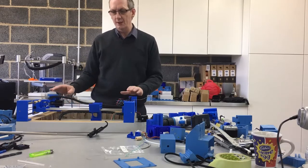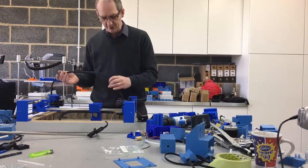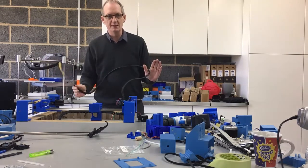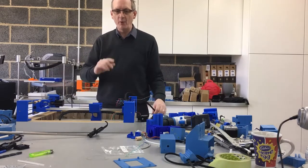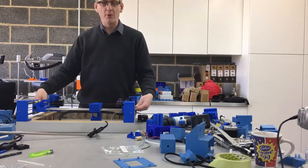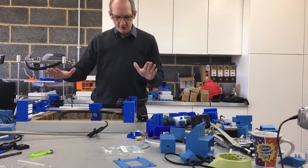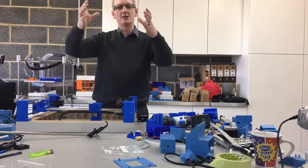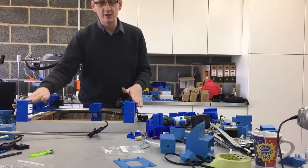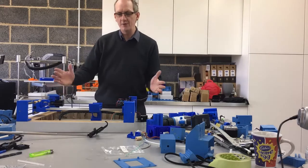That's a quick video showing how the GT2 belt goes in. Both motors are now mounted. We're going to move on to a bit more of the wiring for the printhead before we maneuver to building the base up and getting the top ready to meet the base. At this point we have not tightened any of the rods in their housings yet — that's important. Same with the belts: they're in position but not tensioned, because we want to make sure all four supports go together square on the legs onto the base first, then we can tighten the rods.